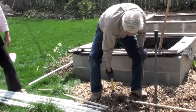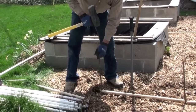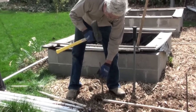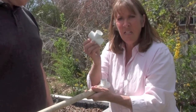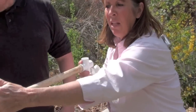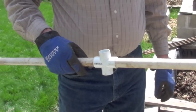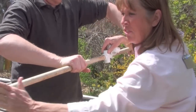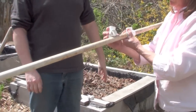Here you can see Laurel is pounding the rebar into the ground using a sledgehammer, getting the sides in. We are taking the four-ways and putting them into our little three-foot pieces to make the spine. Make sure that whoever is holding this keeps all of the four-ways lined up exactly the same — they all have to be pointing straight up, not on an angle.